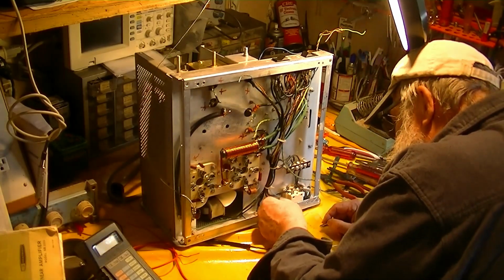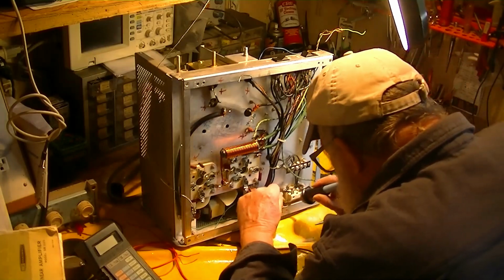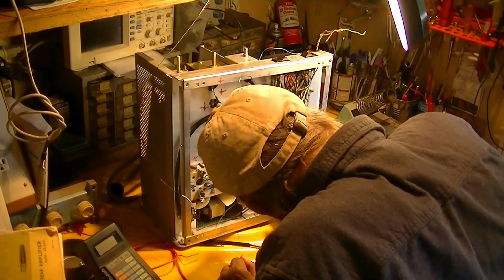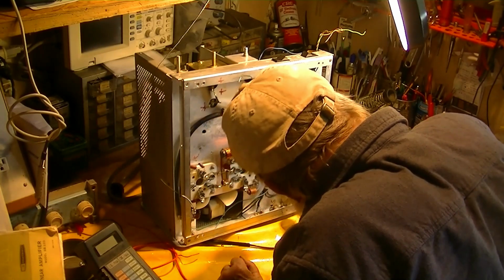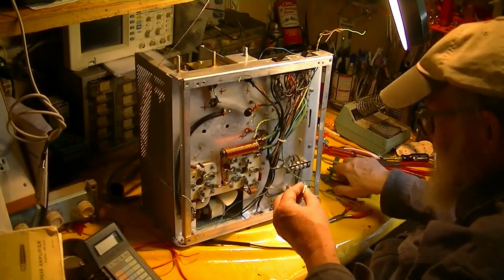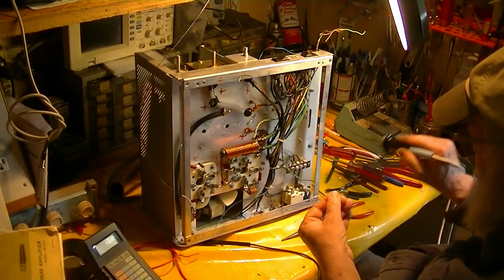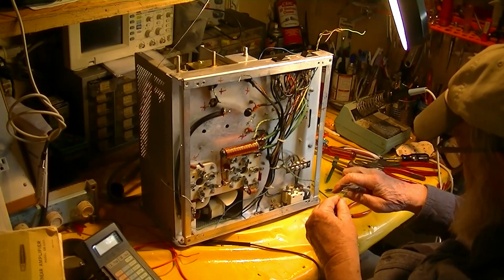And some of these, oh, this is a good classy .022. I've used a lot of these capacitors in radios, usually in audio circuits, not as bypass capacitors. There's so much excess solder here that it's getting down inside the RCA connector. So you can't put a plug in there with a blob of solder running down the middle of the connector. It's crazy. I usually use just ceramics for this bypassing and not these mylar caps. But I'm not quite sure. Probably the only thing he had of the right value. But just a little peculiar for that application.